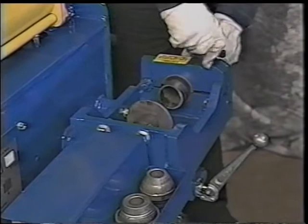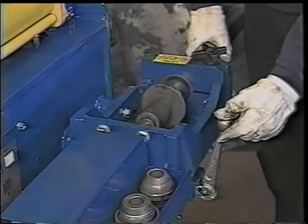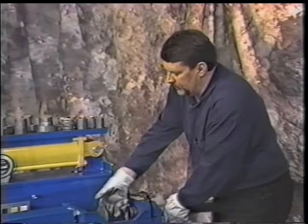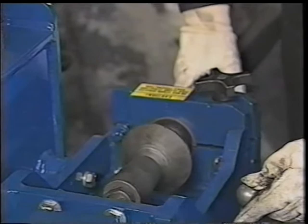We'll then get over here and we'll run the machine into the amount of 45-degree flare that we desire. You can run that back in like so. You have a very nice 45-degree flare here. If you wanted to make that flat, all you do is reverse that tool, slide it back on the collar. We'll then move this machine forward until we have a flat flare.